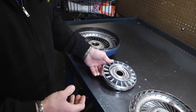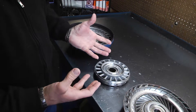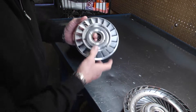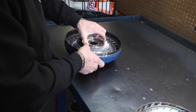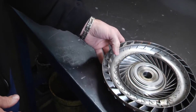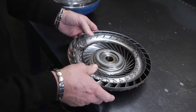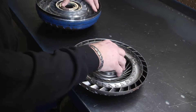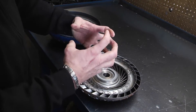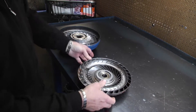When that happens, most likely you'll get a problem where the transmission will try and kill the motor when you're coming to a stop — so that's what this part does. This part here is called the turbine, and it's very similar to this portion here where it loads on top of the sprag, and all the fluid coupling happens within this section of the torque converter.